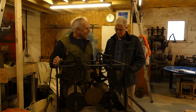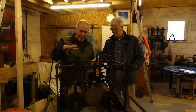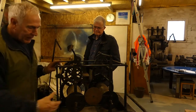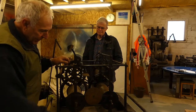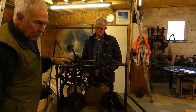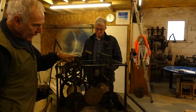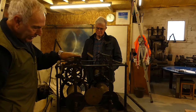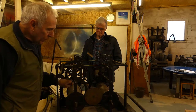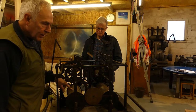Well, other than the paint, because they probably wouldn't have painted it. So this is the clock mechanism? Yes. This side here, from the front and through the left hand side, would be the striking mechanism, which strikes suitable blows for whichever hour is showing. And this is an air brake, just to govern the speed of the strike. And then the lines would go on these two wooden barrels, and that would supply the weight to make the clock go.